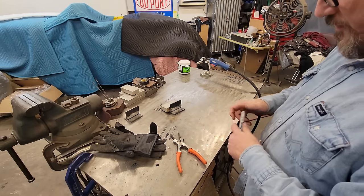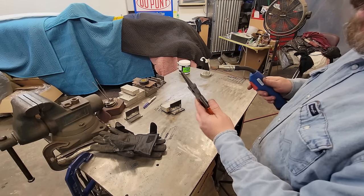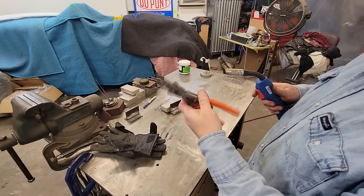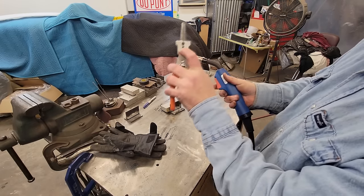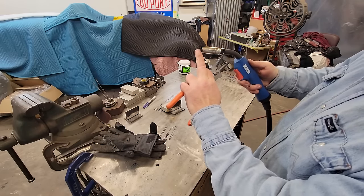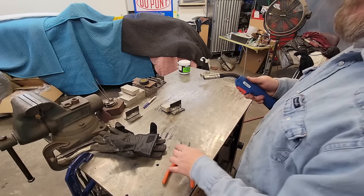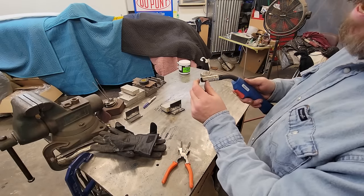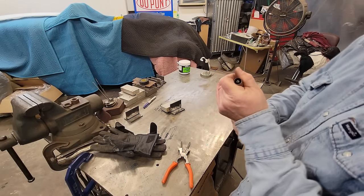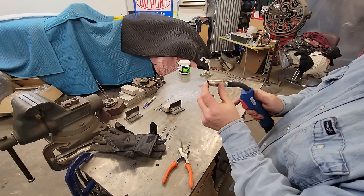So, I got to remember, whip and pause is on this first one. So always what you're going to do, if you notice on these MIG pliers, they're that thick. That's about almost a half inch. So what you do is, see, it's got a hole on this side, the clippers on this side. You can just take this thing with this tip. That gives you about the perfect thickness. I think, if I remember correctly, guys, half inch is like 13 millimeter. So you want about a half inch. You keep a half inch of standoff as you're going. That means you don't want this contact tip in here any closer than a half inch. So basically about that far, you want to be able to see that much wire at all times.